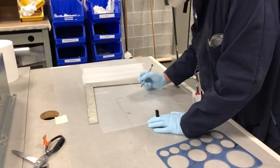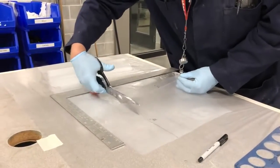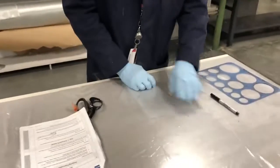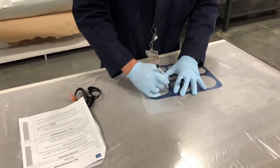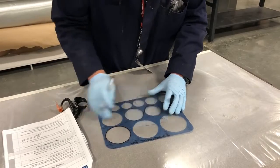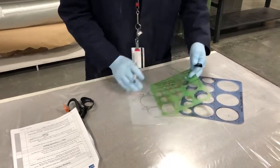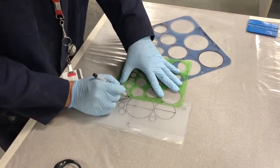We're going to cut some plastic approximately 10 by 10. We're going to draw a bunch of prepreg circles and try to keep them clear of the edge so we don't end up with epoxy coming out the edge of our envelope. We're going to fold the envelope in half, then draw out our three repair patches: the three inch, the two and a quarter, and an inch and a half. We'll also put in three little three-quarter inch patches to use as our first couple of layers, with one as a spare.